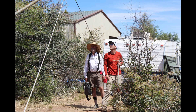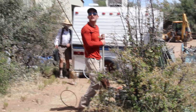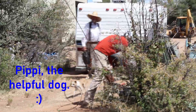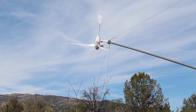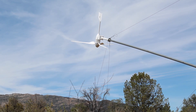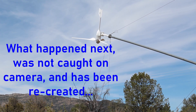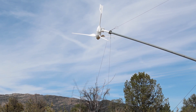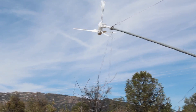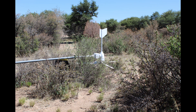That's Teddy and Kurt. Again you see Teddy on the right, Kurt on the left. Teddy starting to winch it up. This is day one and there's maybe the dog of course. Things were going okay on day one. We noticed there was a little bit of different tension in the mid guy wire and the top guy wire and the mast was flexing a little bit. We were slowing down, a little bit concerned, wanted to look things over, and right about that moment — well yeah, it came crashing down.